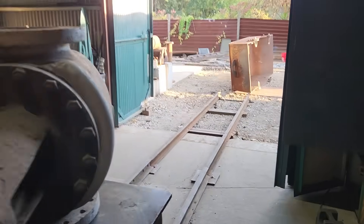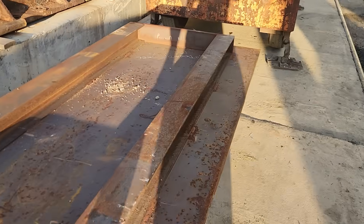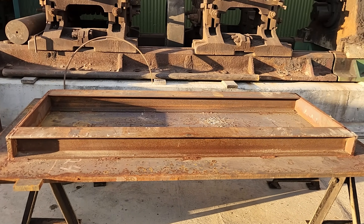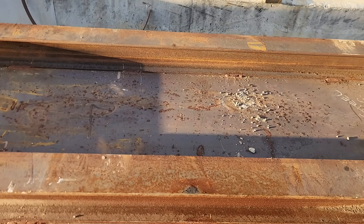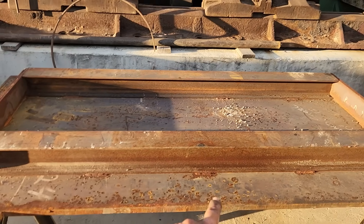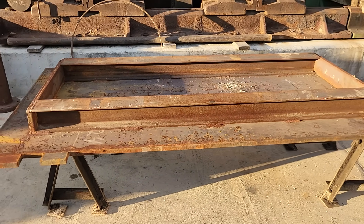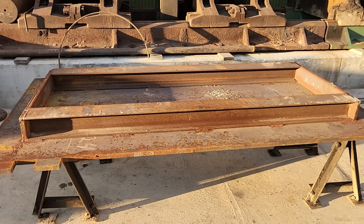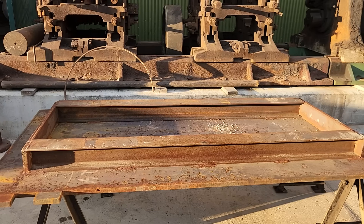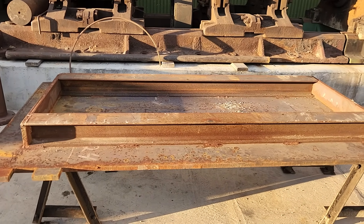Then I started walking around the site hoping we'd have some steel so I wouldn't have to go out and buy any. I realized we had this welding table made out of one-inch plate — and there is the base plate for that oil pan. All we've got to do is come in here and cut that section that's going to be the depression out, drop it down six inches, and put the plates in on either side, and then there are edge plates that go all the way around. We can save ourselves a bundle of money by not having to buy a four-foot-by-eight-foot-by-one-inch-thick piece of plate. I'm going to have someone who's a much better welder than I am actually weld the thing together, but I'll get all the parts and make a giant oil pan IKEA kit.